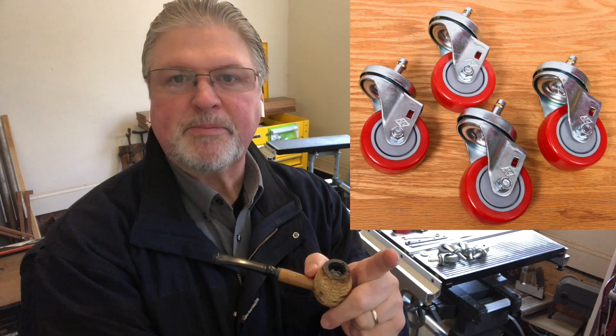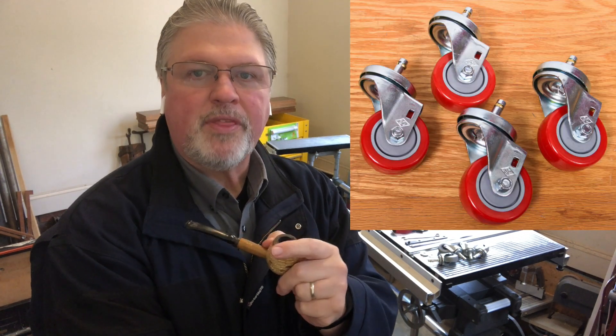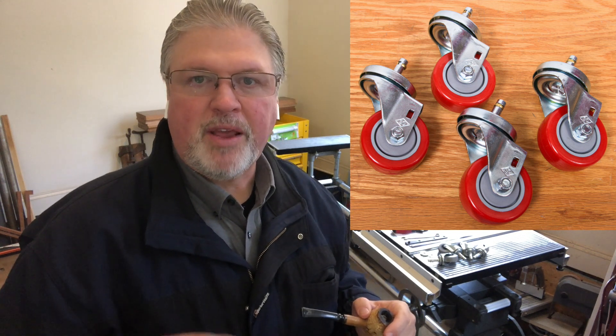Just a few more thoughts on the Shopsmith Premium casters, and then I'll give you my conclusion. One thing I noticed is when I step on the pedal to raise it to the first position, I'm not getting all the way off the ground with all four feet. The instructions address this, and in fact the kit includes four washers that are used as spacers. What you don't want to do is use these spacers if you don't need them, because when the machine should be sitting down on the ground, it may actually be up on the casters slightly. So you install them, flip the machine up onto its feet, and you check it. It turns out mine sits on all four feet, but when I step on the pedal for what should be the very first height, I'm not getting off the ground fully — so that means I have to use these spacers.